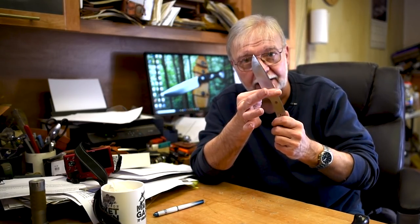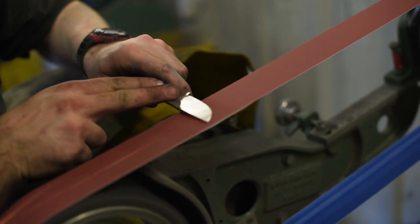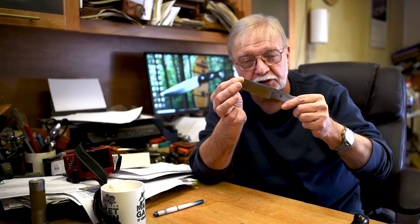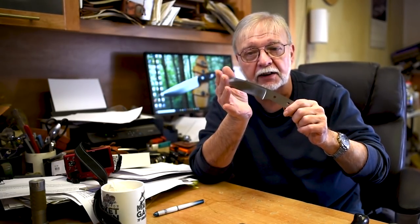The rack is taken to the back line — your blade line. The flat grind is already in there, so the first thing they do is set the convex edge. Then it goes to actually grinding the flat of the blade, not the edge. When you see those spark trails, that's the flat of the blade being ground, not the edge. Their hands are on it — they know when to dip it. We've got guys out there who have been grinding blades for 15, 18, even 20 years. We don't overheat anything. The blade goes down to about a 240 finish on the grinding belts, then goes on the polishing wheels to blend it all together and bring it to its final sharpness.